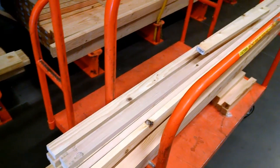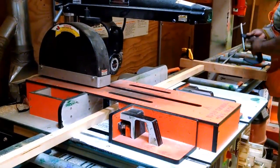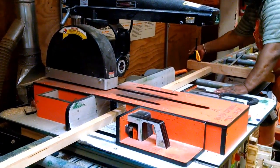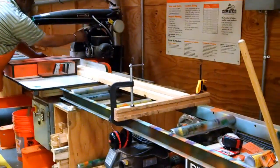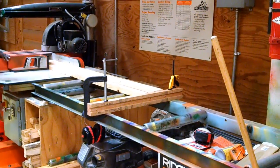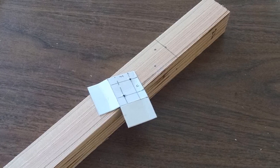The next step was to go to Home Depot and buy some wood because we don't want to drill any holes in the walls or do anything to this room, so we're going to build some frames. I went to Home Depot and had the wood cut down — 82-inch pieces, two-by-twos, which of course are one-and-a-half by one-and-a-half, and some one-inch by two-inch, which is one-and-a-half by three-quarter-inch furring strips, which will be our horizontal pieces. When I got home, I used a template and pre-drilled all the holes so that everything should go together real easily.